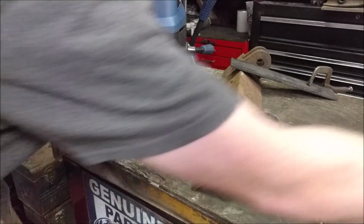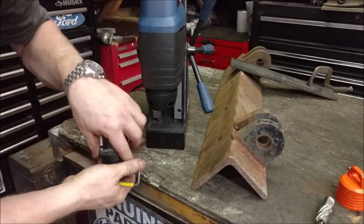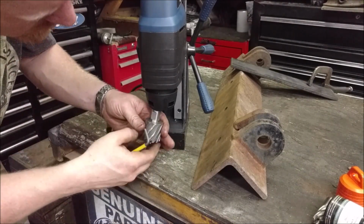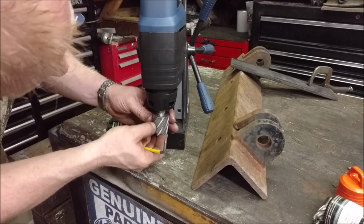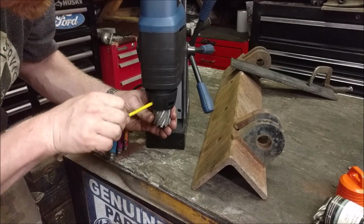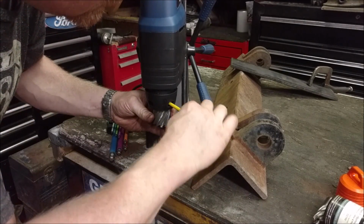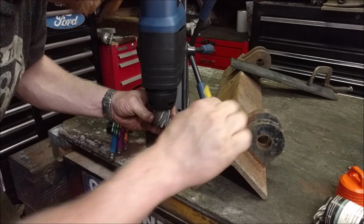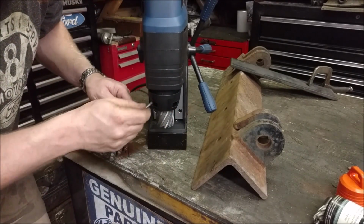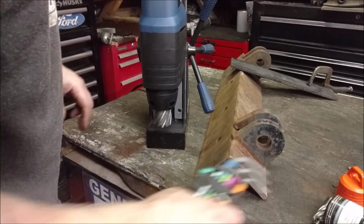But let's drill a hole, and might as well go big. So let's pull out this 1.5 inch guy right here, and we just line up the 2 flats, stick it up in, hold it up in. There's a little bit of spring pressure pushing it down. So we've got one flat lined up. Make sure we've got the other flat lined up. Take our hex key, snug them up, and that's it.